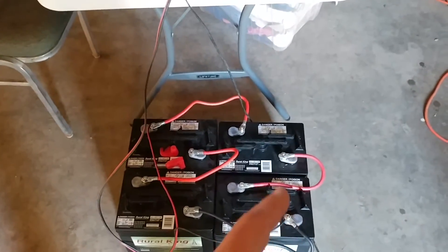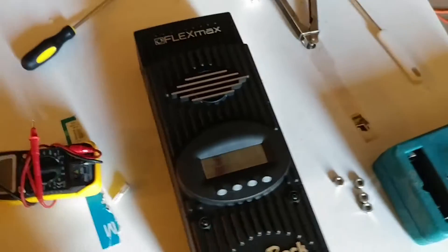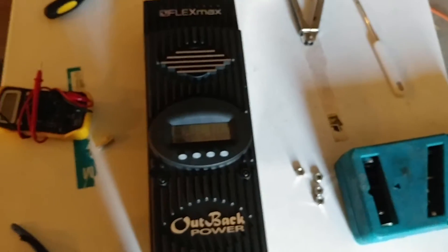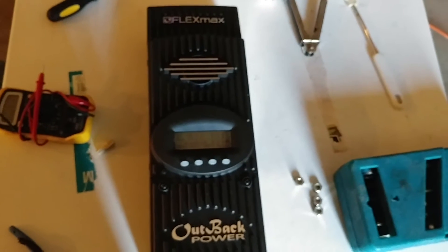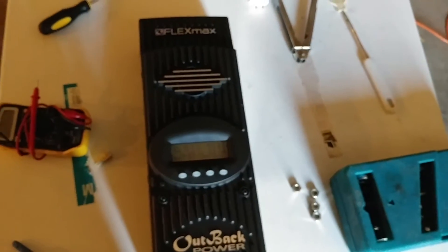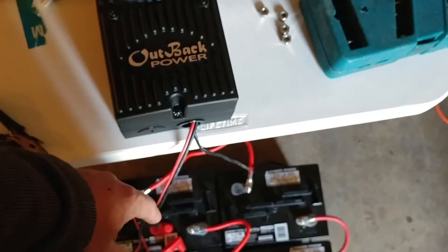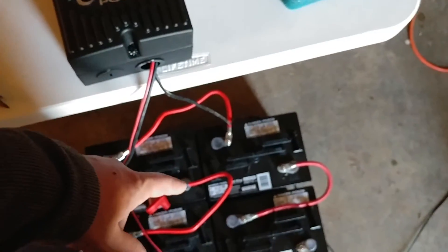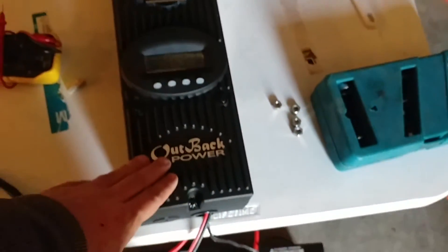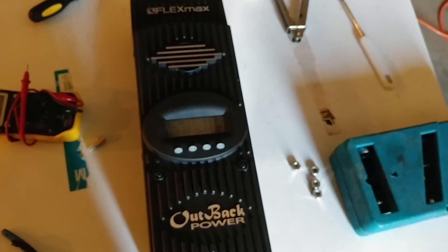I'd have the option of making one 24-volt battery, among other things, but again that's not what this is about. Let's jump over here to the Outback FlexMax 80. This is an MPPT charge controller — that's really the one you want to get. It's the FlexMax 80, or FM80. They also sell an FM60; that designation simply refers to maximum output — the FM80 will output 80 amps to your battery bank, while the FM60 outputs 60 amps. You can dial it from 5 amps up to 80 amps on this one, or 5 to 60 amps on the FM60.